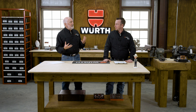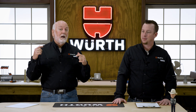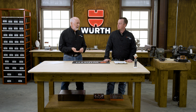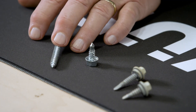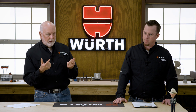We've talked about a lot of different types of screws — screws that roll threads in metals, screws for plastics — and today we're going to talk about self-drilling screws. Now, a lot of customers call these self-tapping screws, but there is a difference between a self-drilling screw and a self-tapping screw. This right here is a tapping screw, and that is a sheet metal screw — it's meant to go into pre-punched or pre-drilled holes.